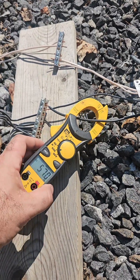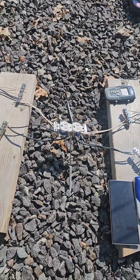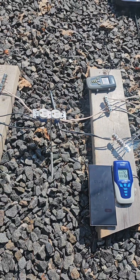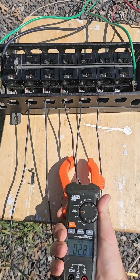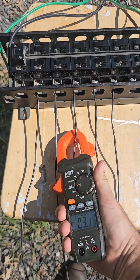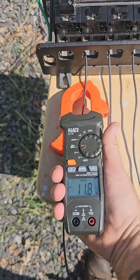We're getting 57 amps on the 10 and 22 amps on the backstab. So there's less resistance in the 10, obviously. Kind of too many variables to tell if that's because of the 10 or because of the backstab. It must be resistance in the different breakers as they're aging on this old panel. We've got 30 amps on that line, 14 on that, 5 on that, 8 on that, and 11 on that.